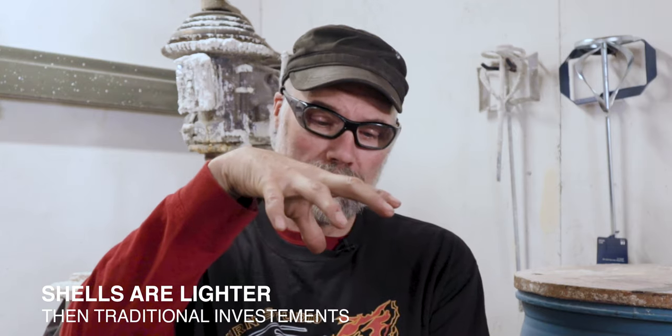The reason why I like using ceramic shell comes down to a couple of key reasons. One, it's lightweight. If we're casting a football using traditional standard investment or sand casting, our mold is going to be roughly about 100 pounds of solid weight because the mold needs to be fairly thick around that shape — it's cumbersome. With ceramic shell, we're creating walls of a quarter inch thick, so the patterns and the shells wind up being much more manageable and a lot easier on the back. I blew out my back a long time ago lifting heavy things, so if I don't need to be picking up a heavy mold, I'm going to avoid that. Ceramic shell works out to be more manageable and better on my body in the long run.